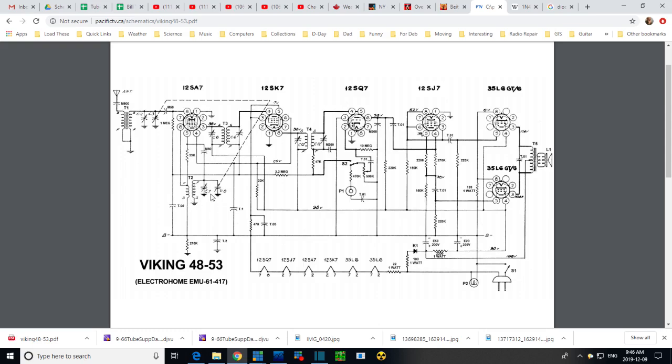This is the tuning capacitor, and I just showed you it's up on grommets, and here they show it grounded to the chassis. Sometimes in these situations there's a heavy, often braided conductor soldered from the frame of the capacitor to the chassis. Maybe I missed that.